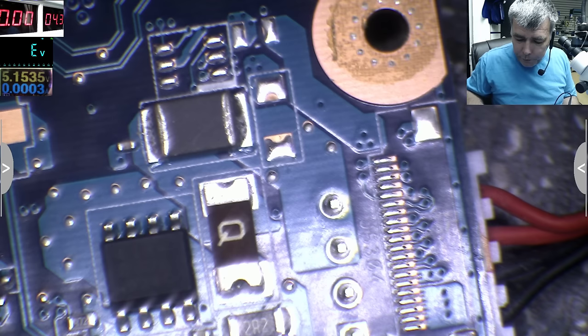After this semiconductor, this MOSFET, yeah, we check again here on these three pins, yeah. Do we have 19? No, we don't have 19. We have 0.9. That's been this semiconductor. You can say it's closed because the current is not going. Or you can say it's open, because if you see this like a switch, the switch is like that, yeah? It's not closed. So this is supposed to be a wire.